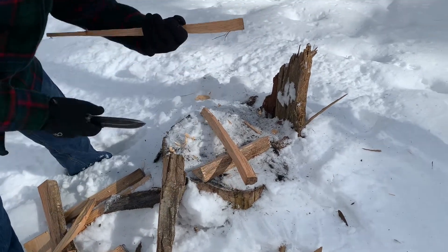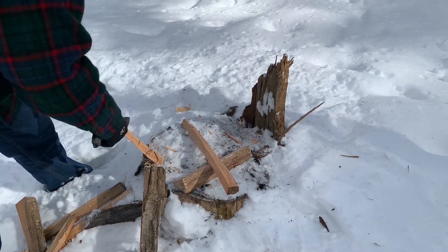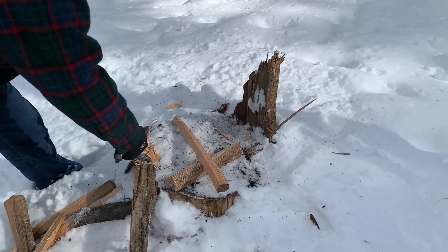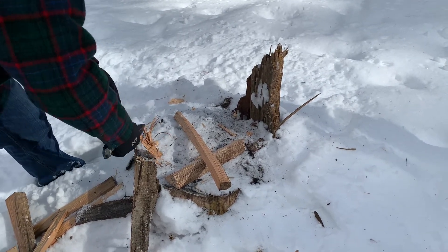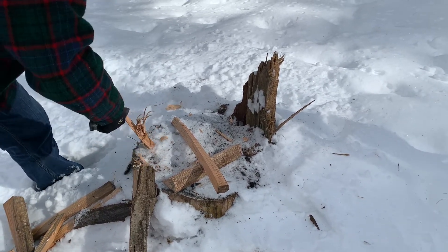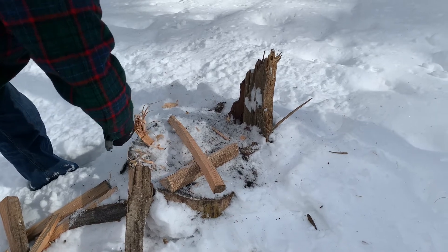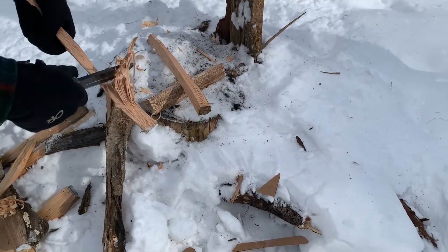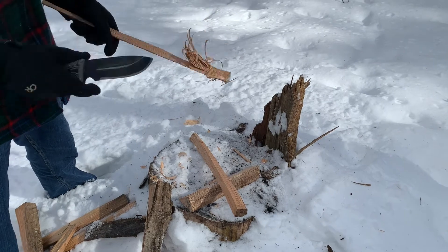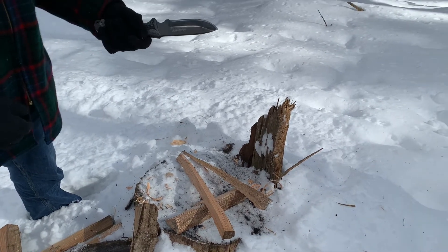Let's look at a piece of red oak — the hardest wood in our forest. Once I get the angle dialed in I'm not putting much effort into this. The quality of the curls isn't quite as good on the oak — it's a little bit harder to get the angle when the wood is harder and it wants to skate a bit more — but I'm not putting a ton of effort in and those are acceptable curls.